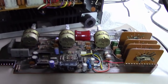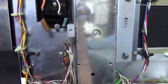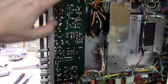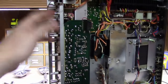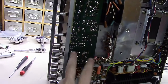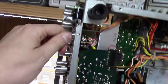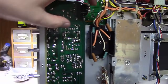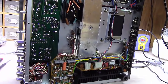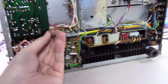Once you've done that, a little wiggling and the whole board breaks loose and comes right out. It's got some capacitors on it too, so we're going to replace those as part of recapping the entire amplifier. We cleaned the pots, recapped this board, DeoxIDed the controls including the selector switch and volume knob, got them all cleaned up, got the connection plug back in, and now we're ready to get going on the dial.